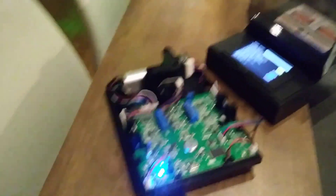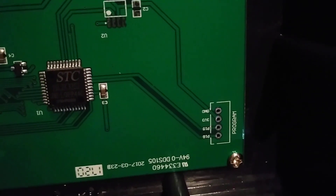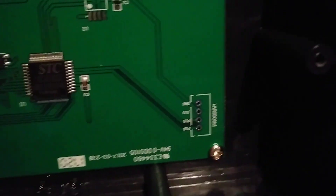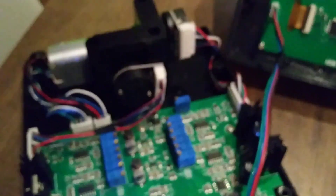I hope you appreciate it guys — for that price it's a damn good deal. I'll end this video with that. On the keyboard there is an input for programming; it's actually written 'program' here. So maybe it's I2C or CAN bus — I'm not sure — there's 3.3 volt, maybe CAN bus. There's no CAN high and CAN low, so maybe RS-485 or something like that. If you have better knowledge than me for that, maybe you can reprogram it for your own purpose. I hope you appreciate this video and thanks for watching, guys. I wish you a Merry Christmas. Bye.